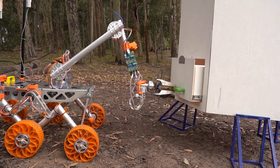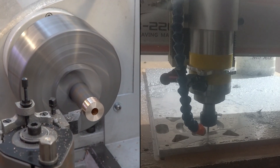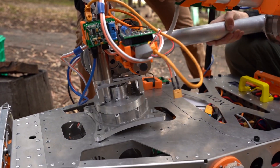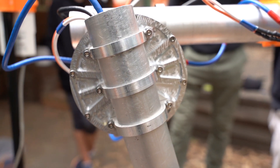To improve stability and control of the end effector, six custom cycloidal gearboxes have been fabricated in-house, providing the arm with low backlash and high reduction. Structural interface components have been optimized using finite element analysis to be lightweight and sturdy, while tubular linkages provide torsional rigidity.